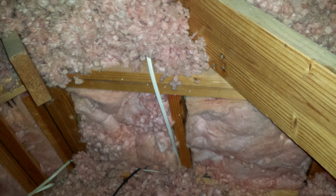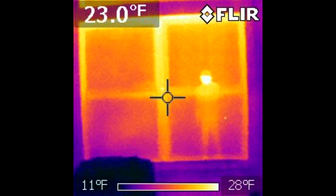Now another thing is you can look around windows, see where some of the drafts are — the cold spots — see if you need to caulk, see if you need to run some foam around the windows on the inside or around the molding, take the molding off and different things.